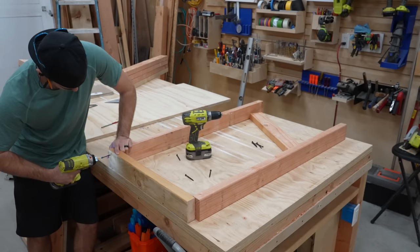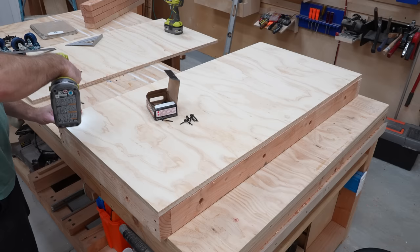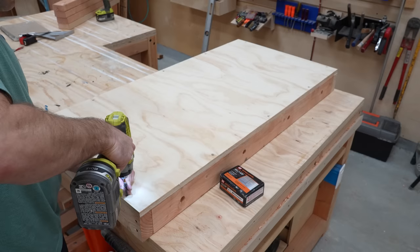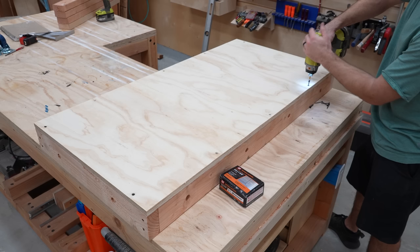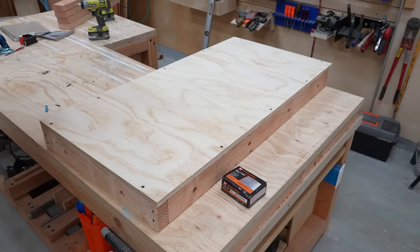The bottom frame goes together the exact same way. Now it's time to add the plywood sheets. I start at one of the short ends, line it up nicely, and drive in two screws — using slightly shorter screws, anywhere from one and a half to two inches. This is your chance to square up the frame. We assume the plywood is square, so we line up the other short side with the plywood and drive in two more screws. To finish it off, I drove in three screws in each of the long sides. Just be sure to avoid putting screws through the bolt holes — you're going to need those later. For the bottom, avoid putting screws too close to the corner, as the screws for the casters will secure the corners.